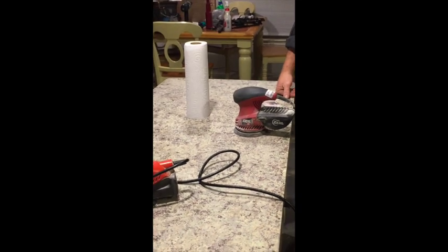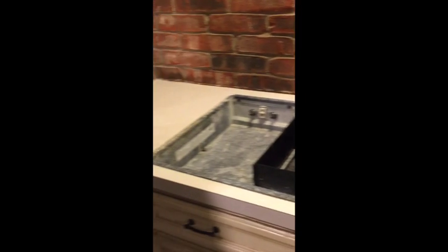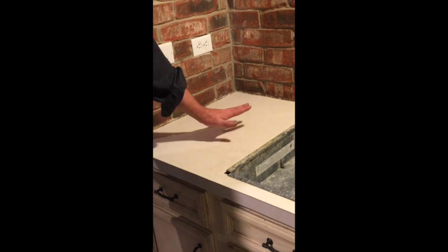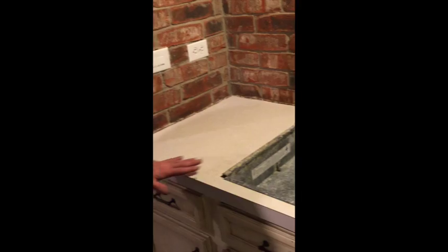I heard from a lot of you that you wanted to know how Tracy and I had made the faux granite countertops last weekend. So for the next surface that we're going to do, we thought we'd make a video to show you. First thing you do to your surface is you need to degrease it, make sure it's perfectly clean. And then before we add the primer, you need to sand it.